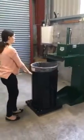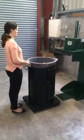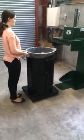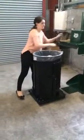Next step is to pull insert out of machine again, and when packer plate will not go down past the top lip of the machine, compaction has been done and the bag can be tied off. This is done by removing the elasticated band, tying the bag at the top, and then opening the side of the bag compactor.